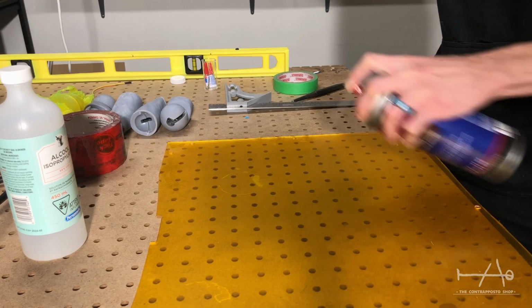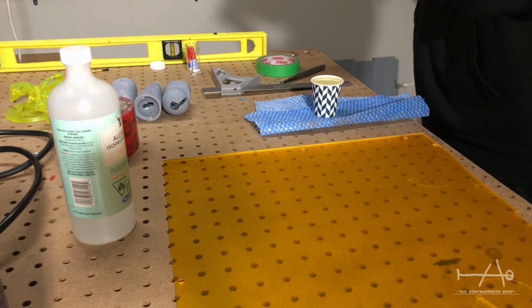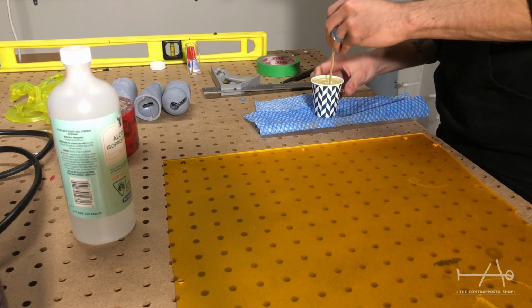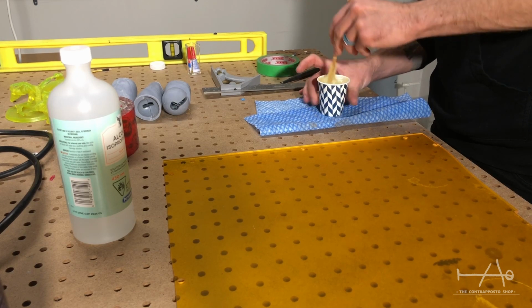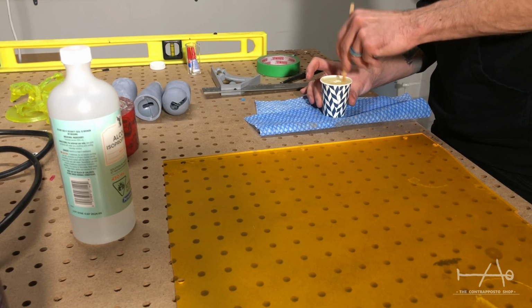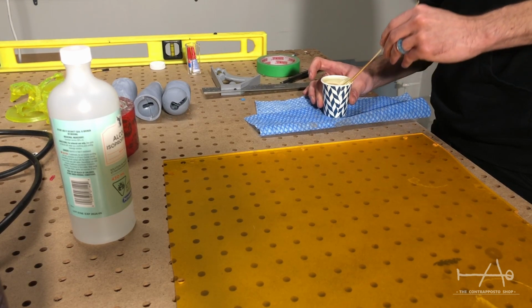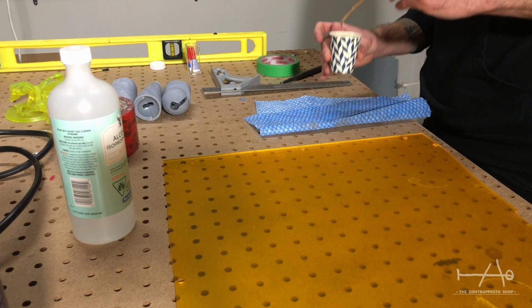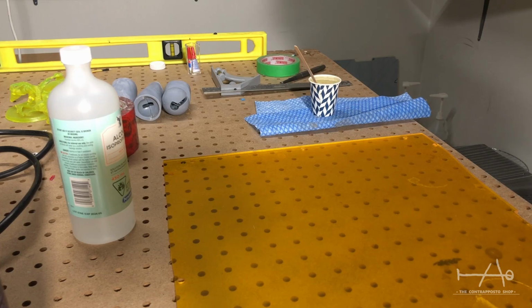The resin we use today is a simple two-part epoxy resin. We have tried two kinds of resin: this one and a polyester resin. The polyester one is much harder but stinks a lot more. With the tests we have made, it works as well as the two-part, but it would probably be more suitable for high temp since its melting point is much higher. The two-part epoxy looks more like a self-healing material if you crush your nozzle on it. You will see what I mean at the end of the video.